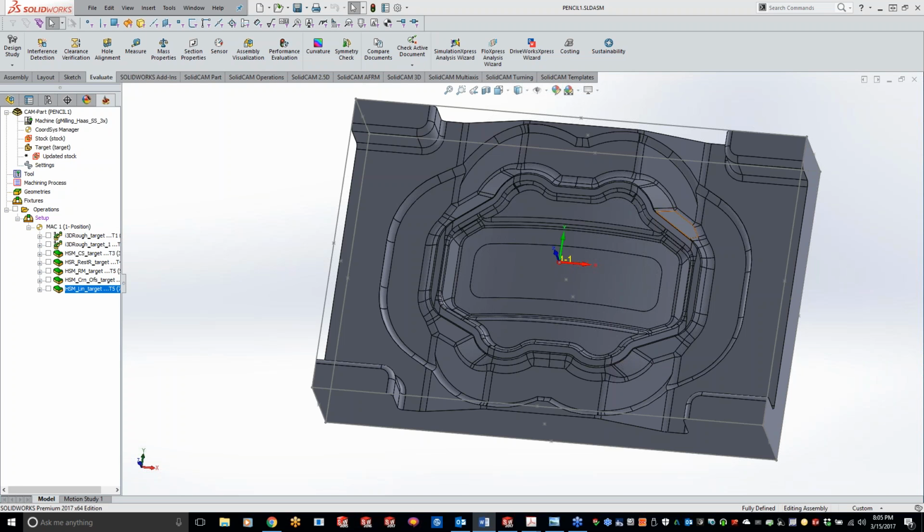So blending gets to be real nice on some of those surfaces for you. So like I said, with that pencil milling, if you're just doing a single line, you might have a little bit of a mark right there. But if you guys use the parallel pencil milling, you guys will eliminate that mark.